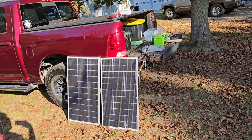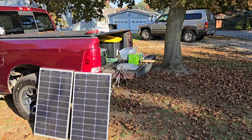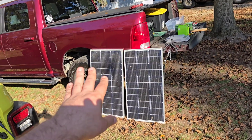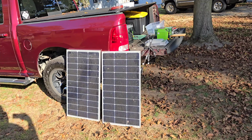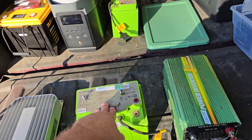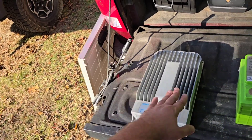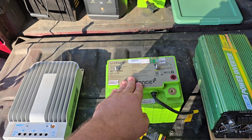All this stuff came from Amazon. This particular system was in one of my campers and now I've reconfigured it. I have 200-watt solar panels that are 12 volt. If you're building a cabin off-grid or outfitting a camper, I'd advise you to stay 12 volt — it makes things really simple. The panels themselves are dirty and not at the perfect angle, so they won't make exactly their rated output. They also can't directly dump into the battery — you need a charge controller, similar to how an alternator regulates to a battery.